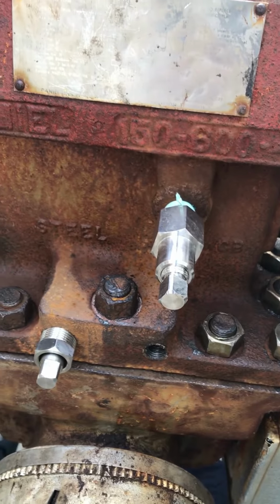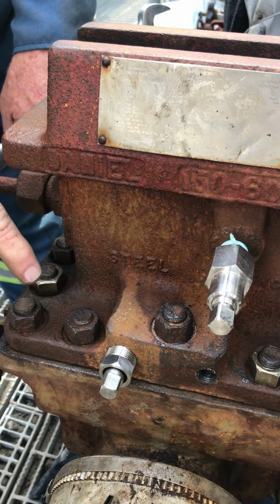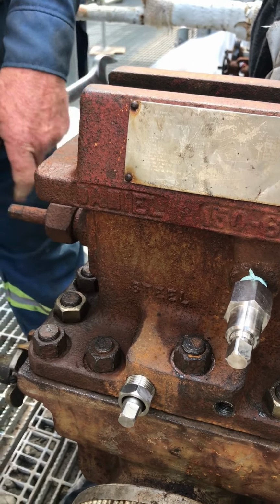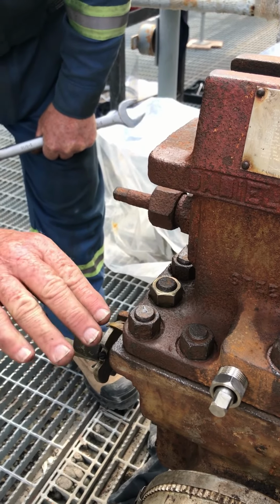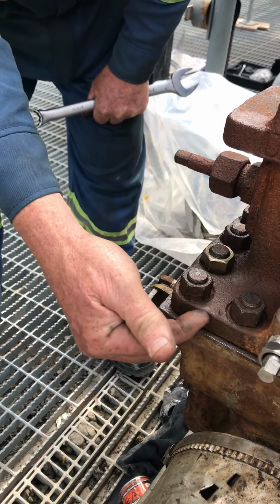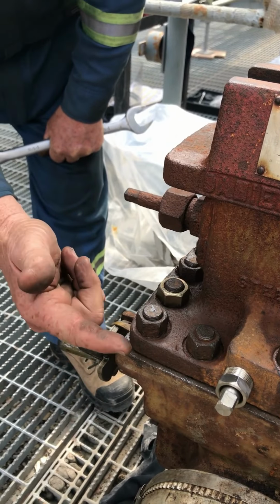These corners here on all fittings, you do not touch until the last thing. You do not torque these down the same as these, or you're in trouble. The reason is, this corner here has no support. You will pull this hunk of metal down over that gasket, metal to metal, and you'll pinch it, and you'll bubble the gasket, and it will leak. Don't matter what you do, and you've wrecked the head.